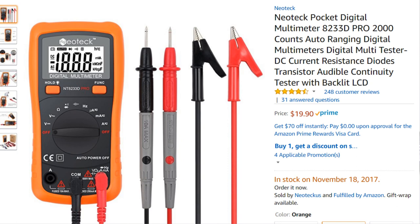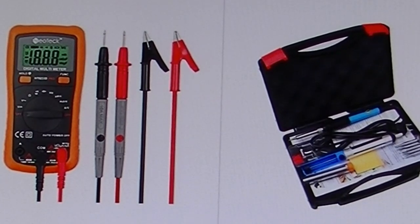You're also going to need something that will measure diodes and check the goodness or badness of a diode. You're going to need to measure resistance in ohms. You're also going to need to assess the value of capacitors before installing them in circuits — these usually only test at low voltages, so they're not the be-all end-all of capacitor testers, but they'll give you a pretty good guideline as to whether the capacitor is within spec. If something is way off spec, or if it's iffy, or if you put it on the resistance measurement and it has a resistance reading, that throws up a red flag — you might be looking at a bad capacitor. There are lots of things you can do with digital multimeters, and lots of things you cannot do without one.